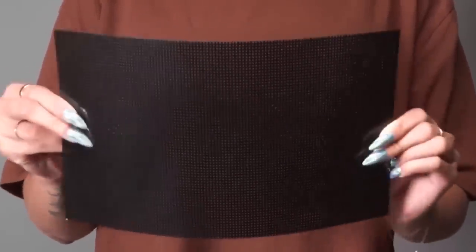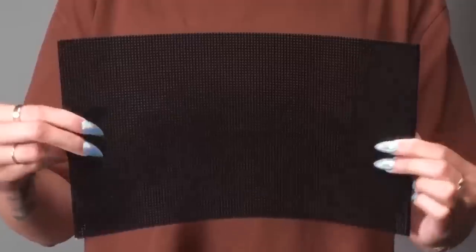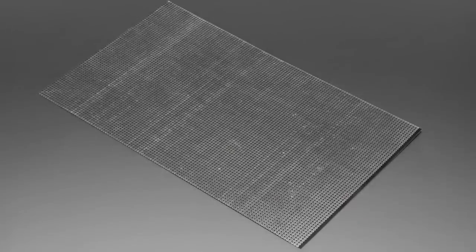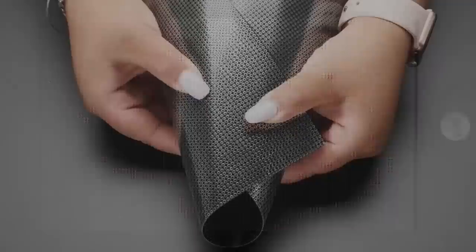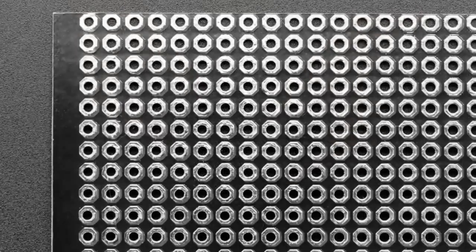Yeah. This is recommended from people doing wearables. This is a flexible, super skinny circuit board. It's a proto board, but it's like 0.4 millimeter thick, so it's flexible, as you saw. It's also cuttable. You can cut this very easily with scissors, or of course, if you have diagonal cutters, but even plain scissors will be able to cut this. It's quite thin.